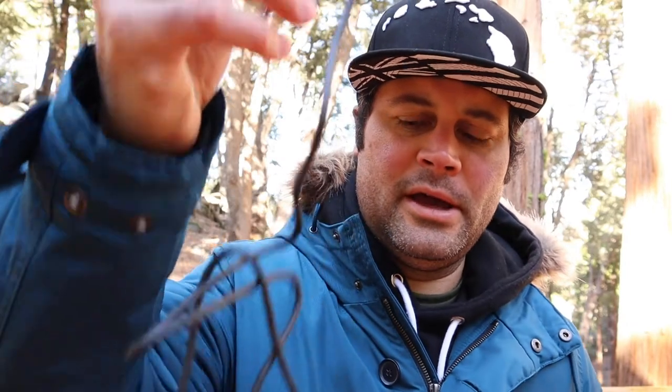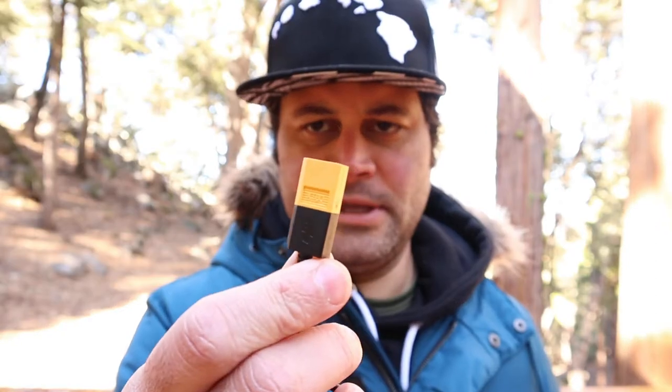You can probably tell I'm starting with the goggles and moving towards the air unit afterwards. The goggles come with this wire to power them, and it goes into an XT60. I'm running a 3S battery right now, but I believe the goggles also do up to 4S. I don't know the full system yet, so I'm being careful. I know the air unit does up to 4S. I'm actually running a regulator so I can run 5S. And the goggles, they might take 4S, I don't even know yet. I'm running them on 3S because that's what I use to run my Crossfire, and when I'm doing analog to run my Clearview, so might as well, I'm running the same thing.